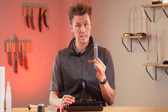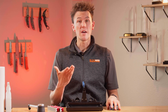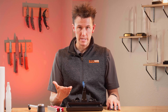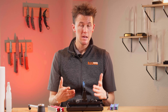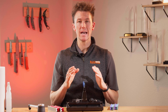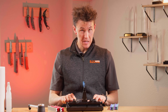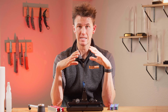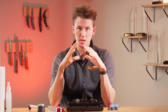We're going to use our fine grit diamond stones to find our angle and sweet spot for this blade, if you don't have it already recorded. If you need a little refresher on how to do that, check out the link in the description — it'll walk you through that process. I've clamped this blade in its sweet spot and already found the angle for it, but it's really important to note that when I put a convex edge on a blade, it's going to add about 2 degrees to the final edge angle. This blade has a V-grind on it at 19 degrees, meaning when I'm finished putting a convex edge on it, the edge angle will be about 21 degrees — not exact, but pretty close.